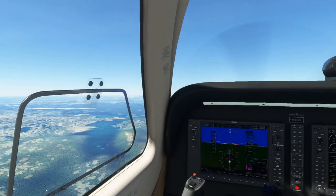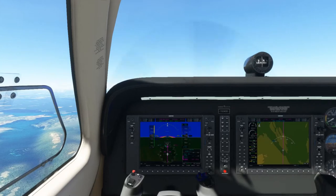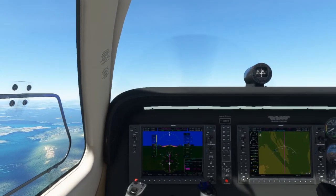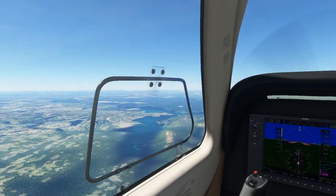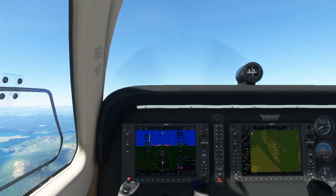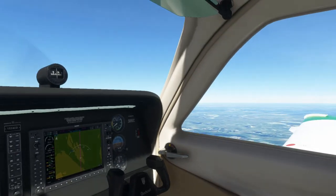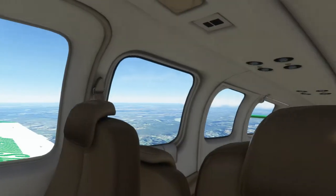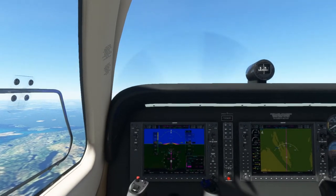So yeah. The most challenging. Why don't you go do that right now, man. You got 30 minutes. I'll get 2 hours here, 2 hours there, and I'll go down and do that stuff. But the hardest part is obviously putting the 2x2s into the concrete walls. Drilling in concrete takes a while. I gotta drill for a little while, and then put it down and let it cool. Using a concrete bit. Yeah, I snapped two bits a while back, and I thought, you know what? I'm going too much. I need to cool them a little.